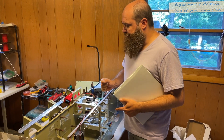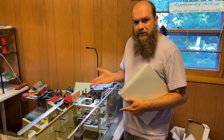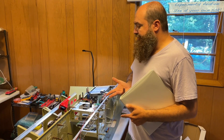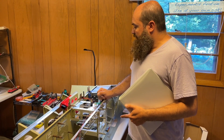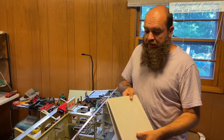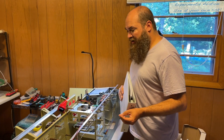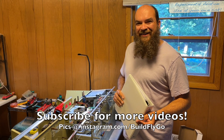Maybe we'll even start mounting some of the avionics and powering them up at that point, since they'll have power pins. Of course, nothing that transmits should get power until antennas are connected to them. Things that just receive should be fine to power up — probably worth triple-checking. We might get some blinking lights at that point, then shut everything down and start looking at the data wiring, which is all defined by Garmin and the other vendors — the interconnects and all that. I hope you enjoy following us along. We'll get some time-lapses going of putting this together. The benefit of the time-lapse is you don't hear me swearing about things. We'll see you soon.